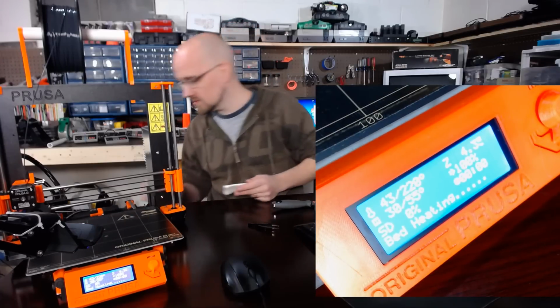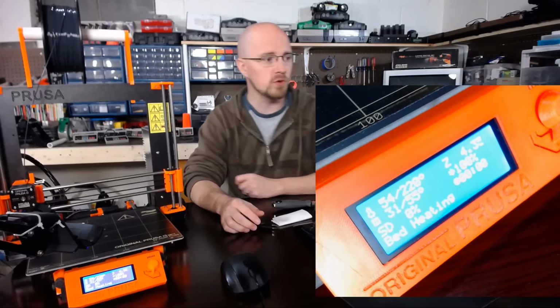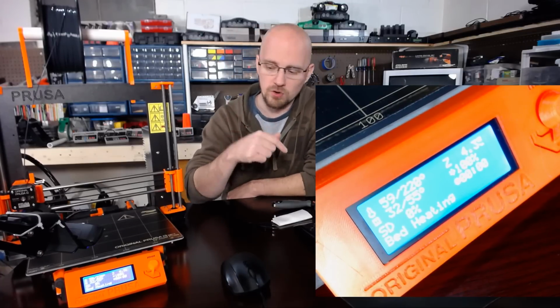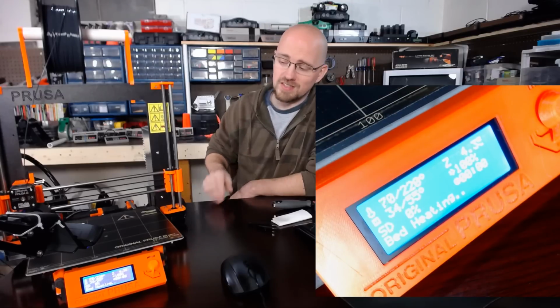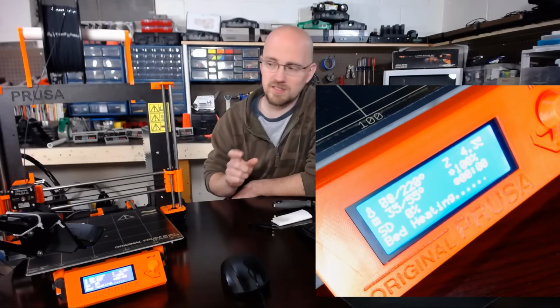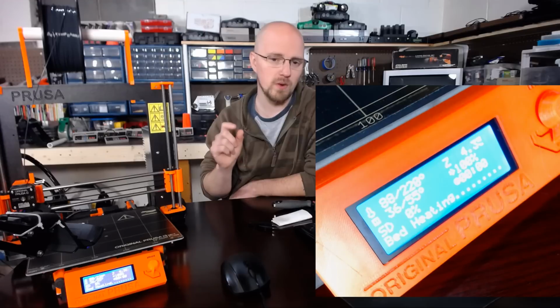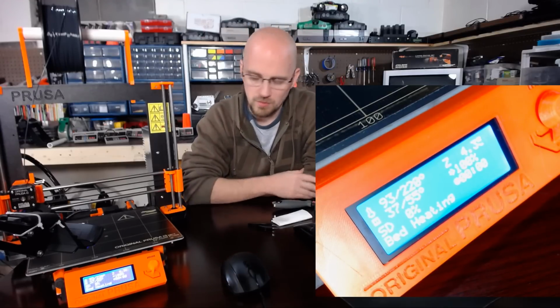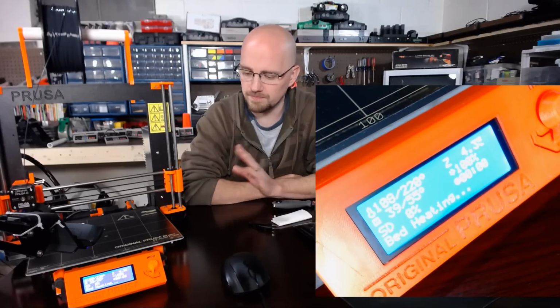And I did notice, I threw the piece on the floor, I think. But if you watched the one video I did earlier when we updated the firmware today, I had mentioned that it does the V2 calibration at 210 Celsius, and this filament is printing at 220. So our first layer went down a little thin, which it's not really a problem. Like, I probably should do a live Z adjust while this print goes, but we'll just leave it. It seems to be doing okay.